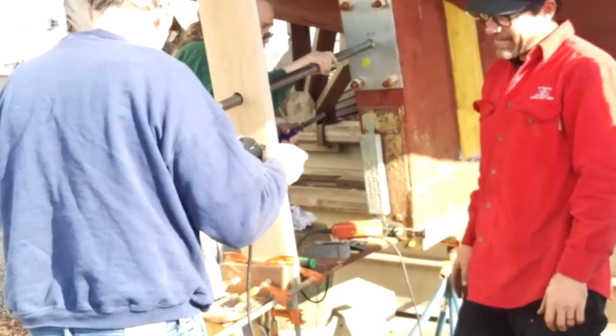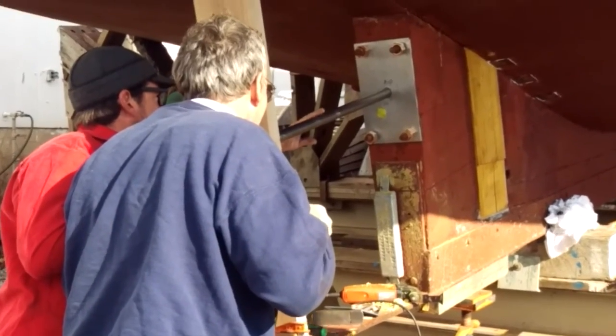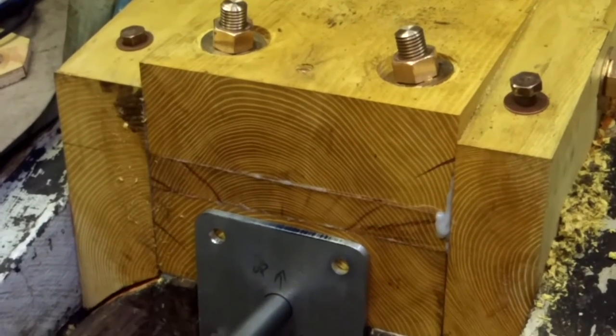Milling through the grain can be quite a bear, and the strong, rot-resistant Osage Orange required careful teamwork. Being keenly attuned to both feel and sound helps ensure a successful operation. Also, slightly dulling the auger kept the drill from aggressively recoiling as it bit into the next vertical piece of the deadwood.